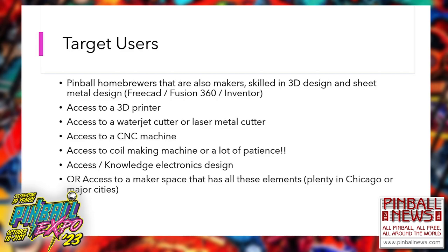If you have access to certain tools you can make these parts yourself. For instance, if you have access to a 3D printer you can make many of the parts for the pinball machine. If you pay attention to some of the machines on the expo floor, there are several companies that have 3D printed parts above the playfield you can see directly, and many others have 3D printed parts underneath. 3D printed parts don't have a great reputation but that's wrong — whether they break depends on the direction of how you do the print. To make metal parts you need access to a water jet cutter, a laser metal cutter, or a CNC machine. You also need access to a coil-making machine.